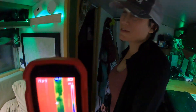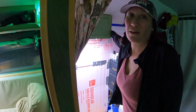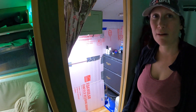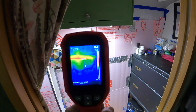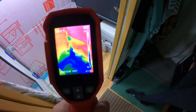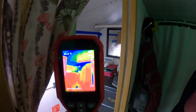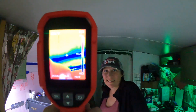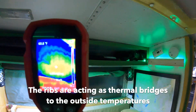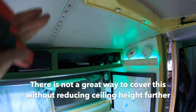The bathroom has a whole layer of Reflectix underneath, with extra pink foam stuck against the wall — we're going to actually build a proper wall for this. Readings are around 70 degrees, but 55 in one corner and 51 near the bucket — still a massive improvement. Every single ridge on the roof that gives the school bus its strength is basically a thermal bridge to the outside, because there's an I-beam going from the interior right to the outer skin of the roof, just radiating heat.